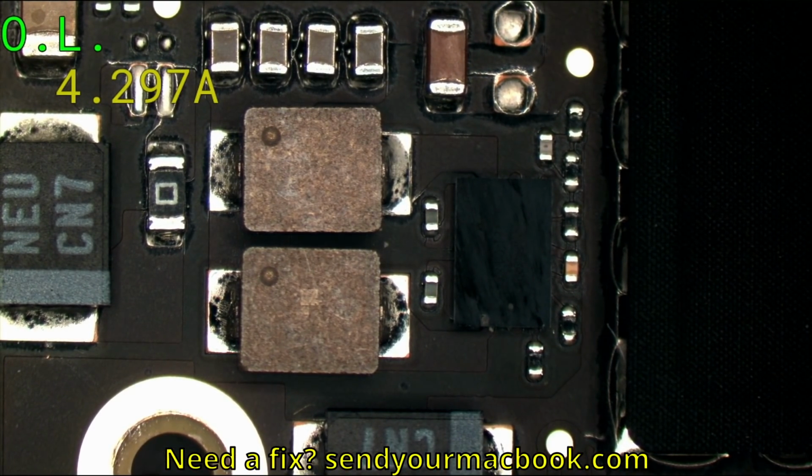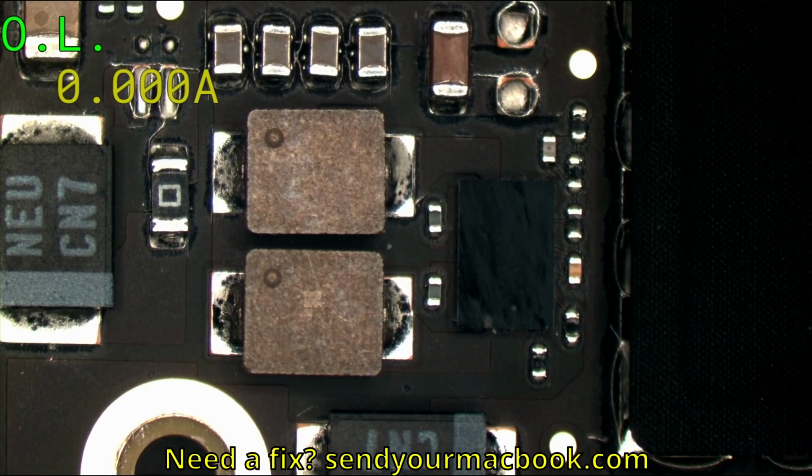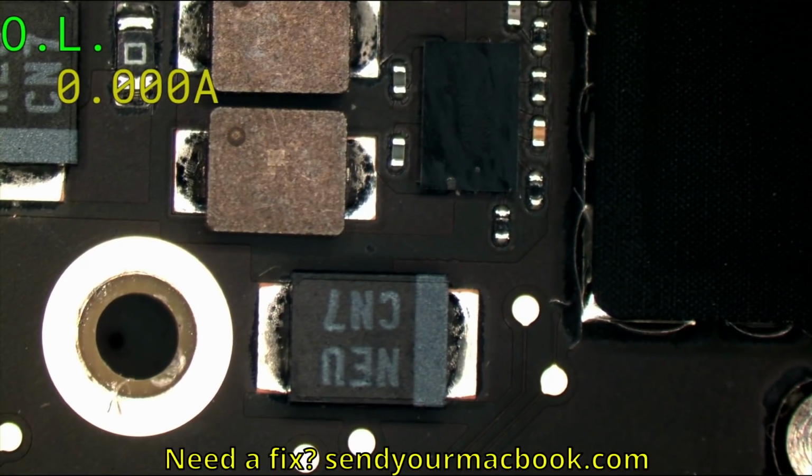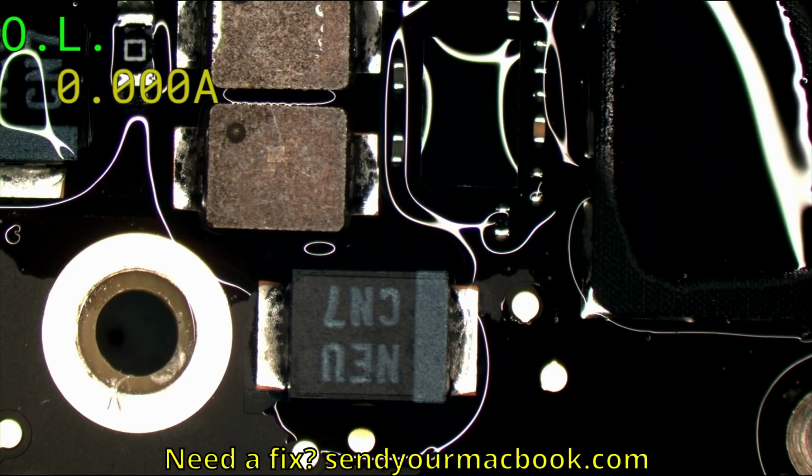All right. Now I'm going to turn off the power supply, or just unplug something, and we are going to put some alcohol over there. Again, I can't use my other thermal camera because I am using Linux right now. It uses some weird Chinesium software that I'm very lucky I even have working on Windows, much less Linux. So we're just going to toss some alcohol on the board in this area and see what gets warm.